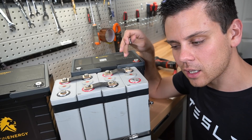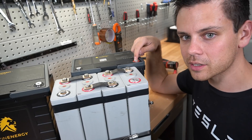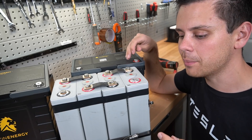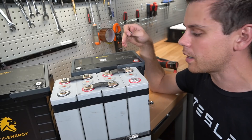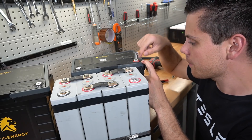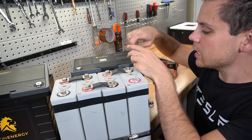My lithium titanate cells have this same problem. Also, when you stack multiple lugs — for example if you have an inverter and you're paralleling at a single point, so you need three lugs — by ABYC standards you can have three lugs on bus bars and batteries. I wouldn't trust this terminal for that. Look how much thread is available: you can fit two lugs on here, but a third — absolutely not. So there's just less leeway.